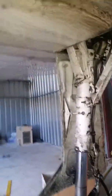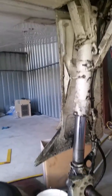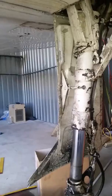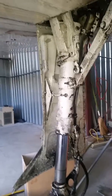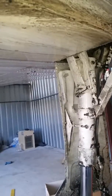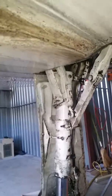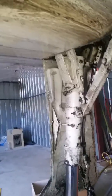It moves up and down smoothly. Now it's time to service the strut. We'll put fluid up in here in the top with a hose and then pump this up and down several times until we get no more air bubbles coming through our clear hose. That will give us all of the hydraulic fluid that we need in the strut. Once there's no more air bubbles, then we'll close it off and cinch it down up there. There's a 5/8" nut that closes off the hole, and then we'll put the valve core back in and inflate it with 310 pounds of nitrogen pressure with it off the struts. And that should give us the proper load.